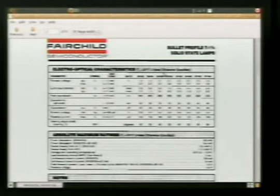We see the serial numbers for our different versions, our different colors of the LED, and it's telling us the different values, the different voltages. We've got a typical and a max. The max is obviously the maximum. You don't want to set your normal operating to the maximum voltage. You want to set it to the typical, so it's what you normally want it to be. In this case, if we were going to use this LED here, it's 1.6. So going back to our Hello World circuit that we did earlier, now we've got 3.4 volts too much instead of 3 volts too much. So we'd have to redo our Ohm's law and figure out the minimum resistance value that we need. That's the cool thing about data sheets.